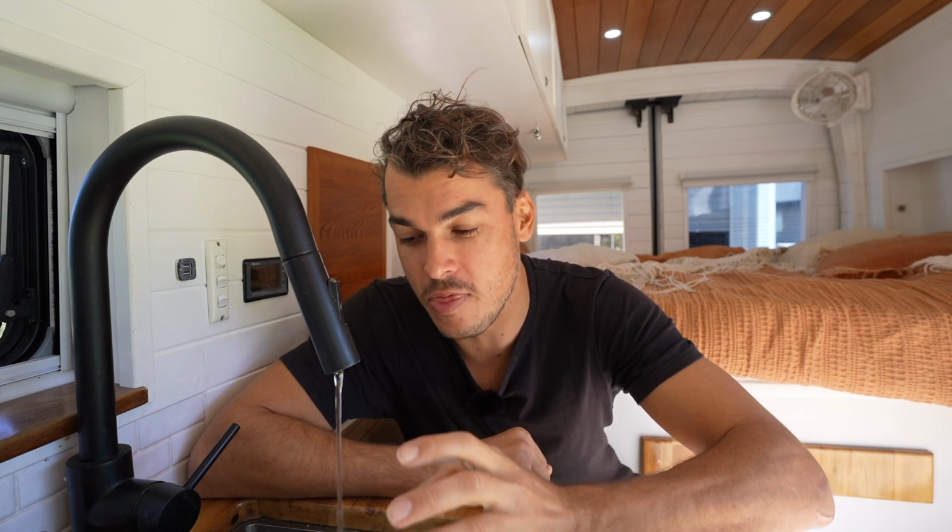So you can see it's coming out much more steady and I can hear the pump only cycle every now and then as it's recharging the accumulator, as the accumulator is holding the pressure in the line and creating a much more steady flow. Now if I put it all the way up, the pump runs as it was before, so the accumulator is much more noticeable at these low flows as you'll get a much steadier stream of water.